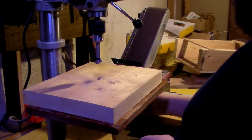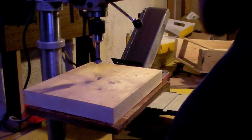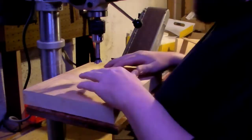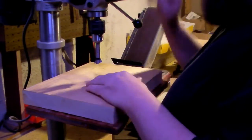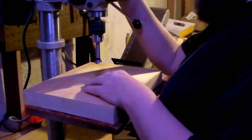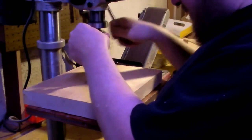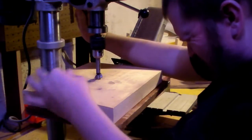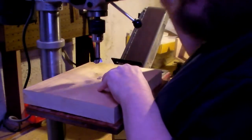Now, in my mind I made a mistake. I kept saying drill a pilot hole, drill a small pilot hole — and I didn't. Now I know why I should have done that. I've done this backwards. I should have started with a pilot hole, and that would give me a place to center this and then center the other one on top of it. I didn't do that, so now the real trick is going to be trying to get this in the center. Just got to do the best I can.